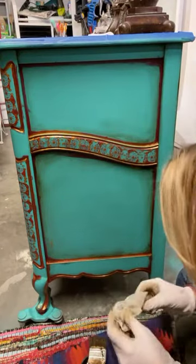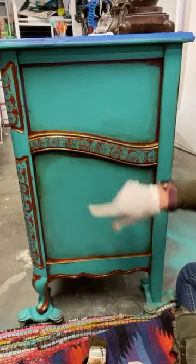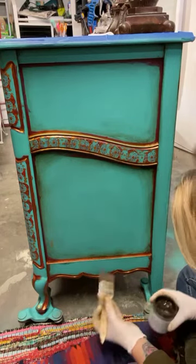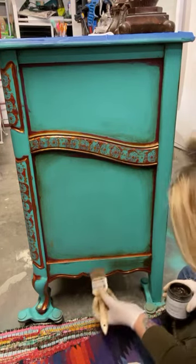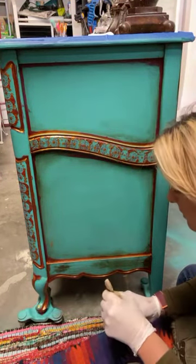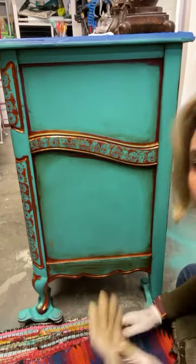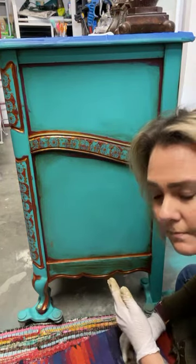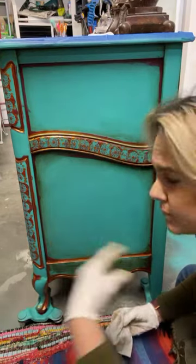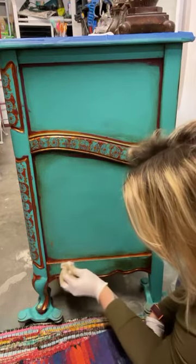With good lighting and all that, this is more where I want to get this top piece going. But I don't want to go over the top part too soon, because if it's still a little wet, I don't want to pull back all the glaze I just did. If you're familiar with staining, going back too soon will pull back your stain — so it's best to let that dry.